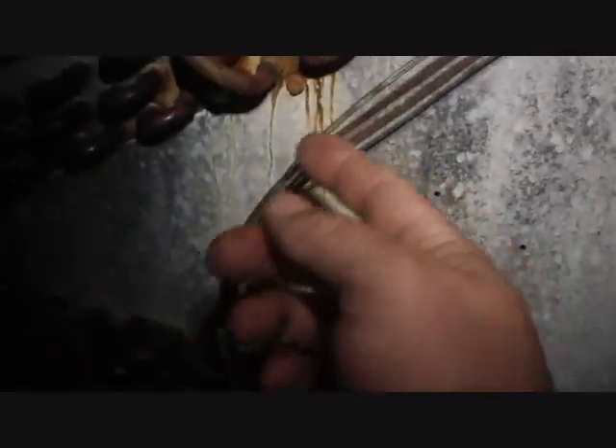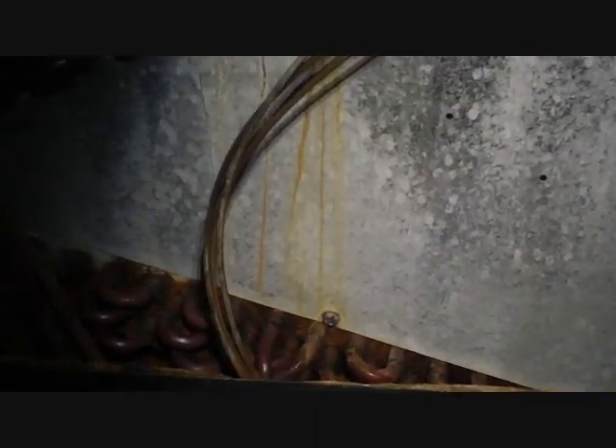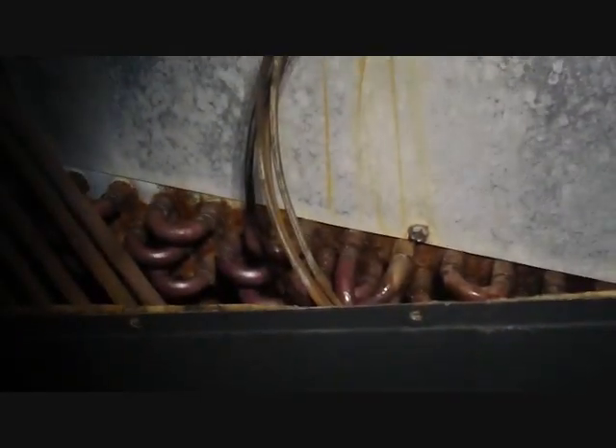I checked the evaporator and didn't find any leaks with the detector. I'm going to open up the blower compartment and look underneath the coil to see if I can find anything — like an oil smut stain or something like that. I always check these tubes here because they tend to rub against each other. I've seen a couple where they rub together, the refrigerant leaked and froze, and there was a block of ice around it — it actually held 20 pounds. That's what I check for. Looking at the bottom of the evaporator — no leaks here either. Some rust marks, but nothing showing.